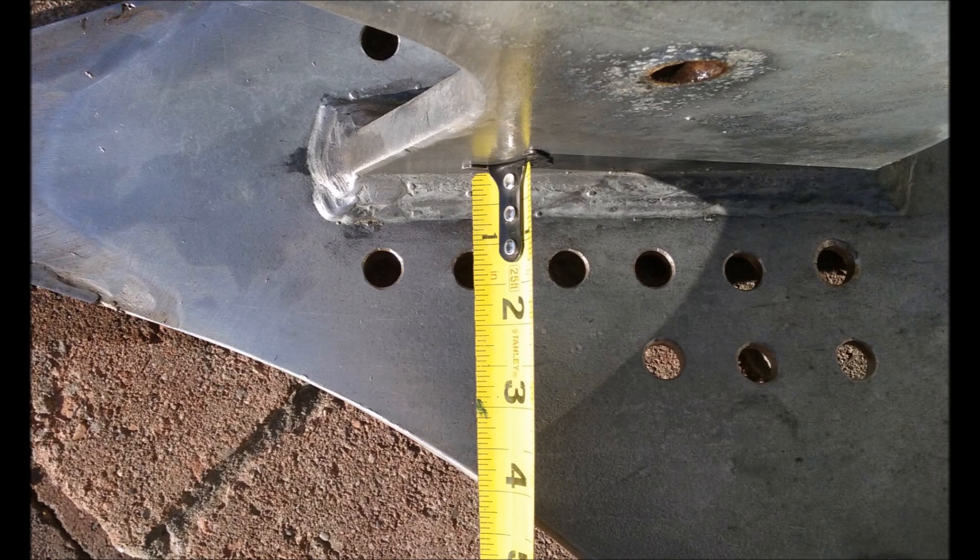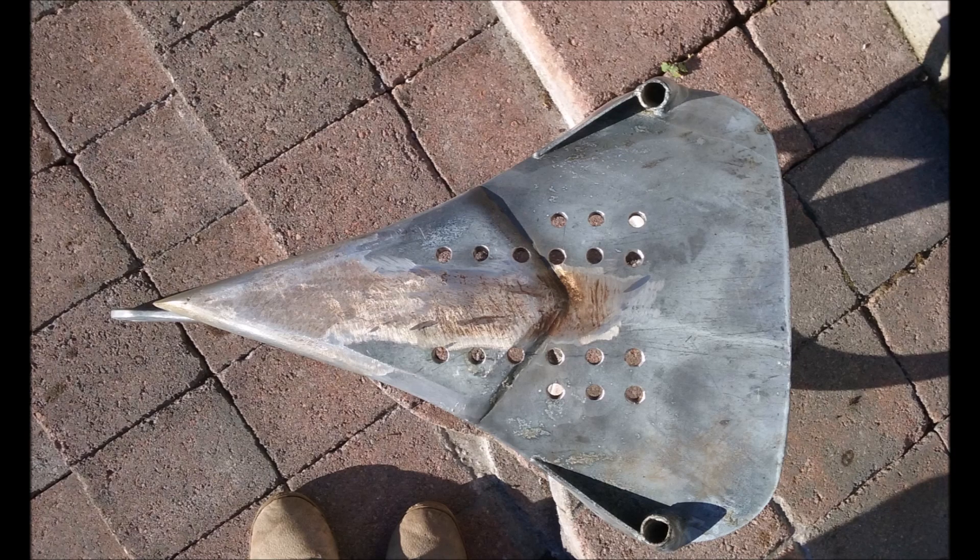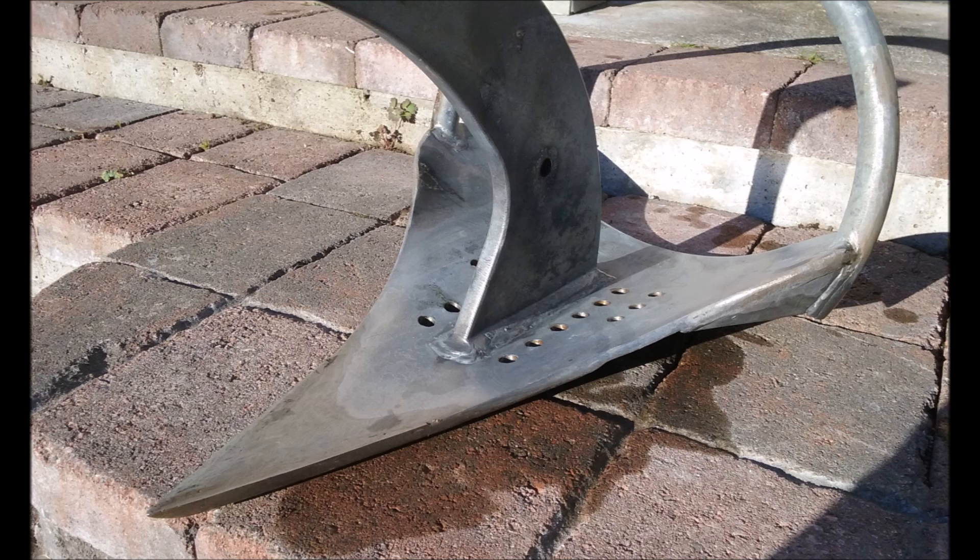I wish I could say it was my innovation, but the information came from Rex Francis — he's the designer of the AnchorRite anchors. These are half inch holes spaced one and a quarter inches from each other. Certainly I've weakened the fluke, but if you want to drill holes in your anchor, go right ahead. For the more rational out there, you can just buy an AnchorRite product because they already have the holes. I do want to clarify that I haven't talked to Rex Francis about this Manson Supreme — he didn't recommend I put these holes here. I'm simply copying his idea because his anchors have holes placed there for this very reason, to prevent mud from occurring. I'd also like to reaffirm that I do not work for or have any affiliation with any anchor manufacturer or seller. All of my efforts thus far have been for my own enjoyment, entertainment, and education. Thanks for watching.